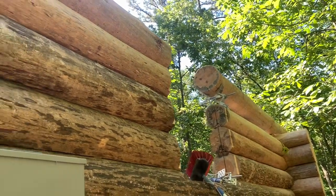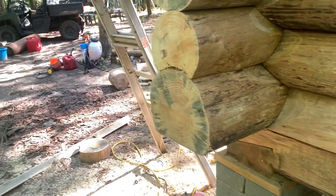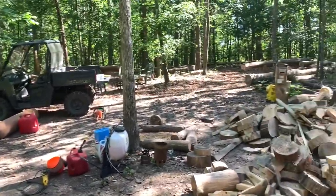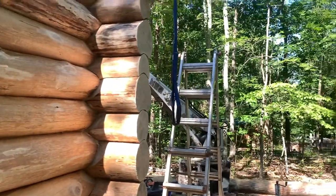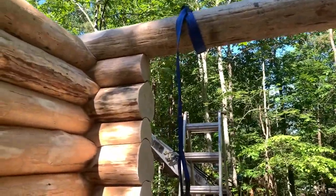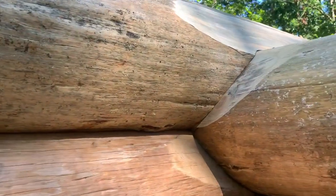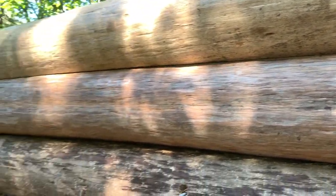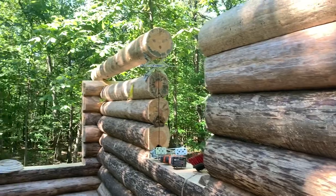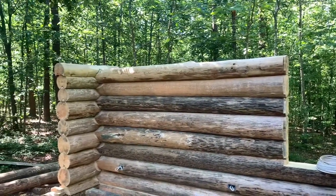Now we're going to hit that one down there. Let me not turn too fast or I'll mess your eyes up. Okay, let's go inside and look. I got to go get me a post and stick one under this cantilever so it doesn't do any bending down or anything, because that dude's heavy. Good joints. Looks good. Turned out well. And I'm gonna hit this other one. And then the next logs will go across the back and the front, and that's a gable log.